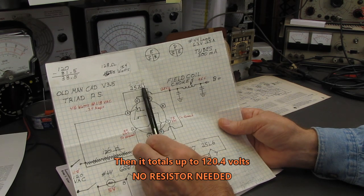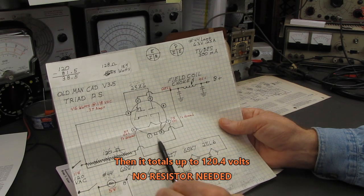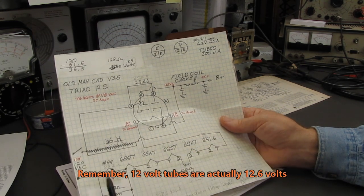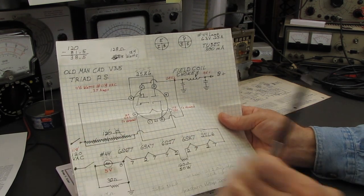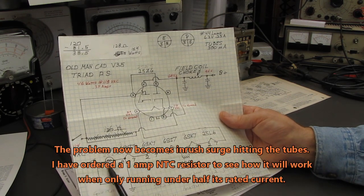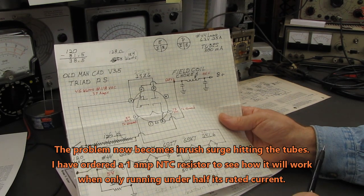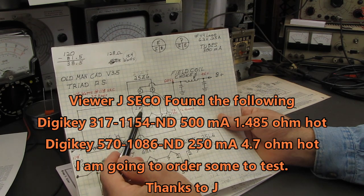Now the 35Z5 only has a single anode and cathode. It's not a dual rectifier, but they're using this as a half-wave rectifier anyway. I can eliminate this resistor and this resistor entirely and run this as a normal series string circuit. We can use the tap on the 35Z5 for our dial lamp, eliminate this resistor, eliminate this resistor, and we don't need any heat producing resistors.